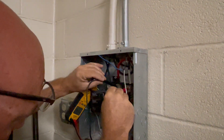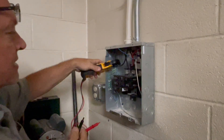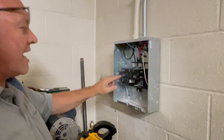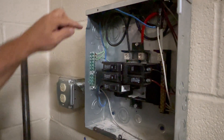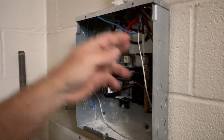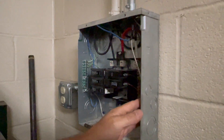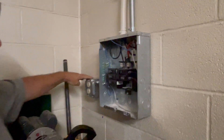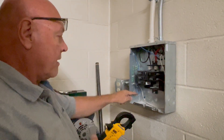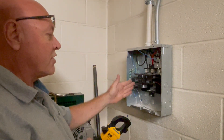I also get 120 volts here. So since these circuit breakers right here are all single ones, I can get 120 volts out as long as I'm using my hot line going out to the system, and then I come back in with a neutral line back from a light or an outlet. Here's my hot line going out through this circuit breaker, and here's my neutral line going back to my neutral bus. So that's all single-phase.